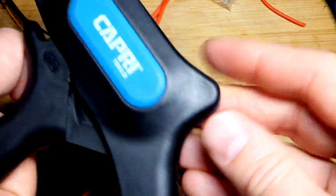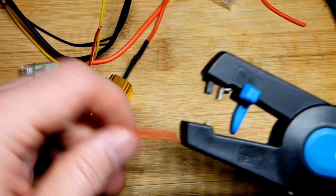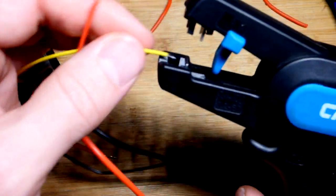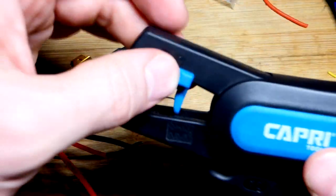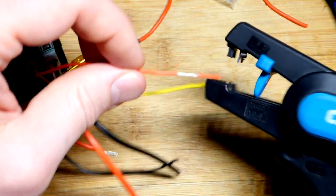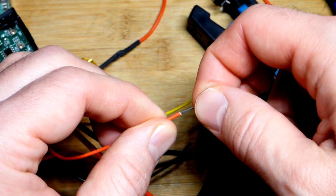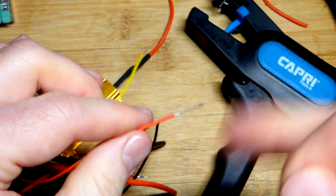To expose more wire, we're going to use this wire cutter and stripper — you can lock it shut right there. With the tongue in the shortest position, that's probably how that wire was cut. We've got about that much exposed, so we're fine. I'll do that with the yellow one. Then we go to the longest position — we seem to have plenty of room in that connector. Squeeze the trigger and it comes off. With stranded wires, if you don't pull it off all the way, give it a little twist while you pull it off — that really keeps the strands together.